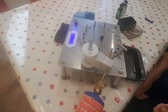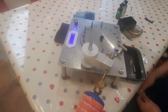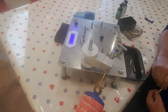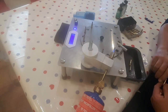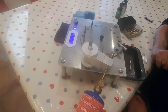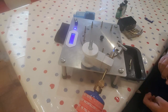Arguably, for the cost of these cases and how often they're going to be fired, it's probably not worth the extra expense of building an induction heater. Looking at the cases dropping into the tray beneath, I can see the slight blue-grey ring that's formed just underneath the false shoulder. So I know these are going to be fine when I come to fire forming — they're going to be absolutely spot-on and I won't get splits.